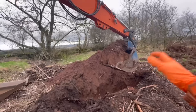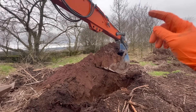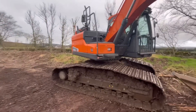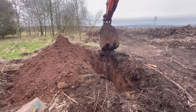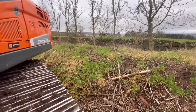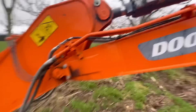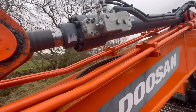There's a little bit of creeping in the bucket when I watch that time lapse back, but that's to be expected — there are no lock valves on that. That'll just be allowable, permissible internal leakage either in the ram or the valve chest. Great — what I'll do is put the arm back down, put the pipes back on, take the bucket off, and I'll be able to reach off the top of this bank to do the lock valve. We'll get this lock valve changed out and get on with the rest of the jobs.